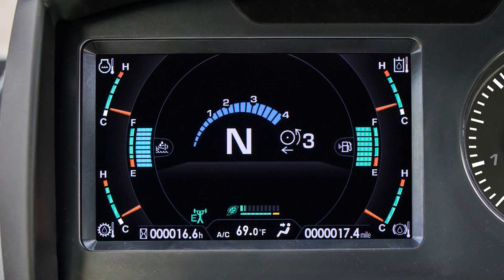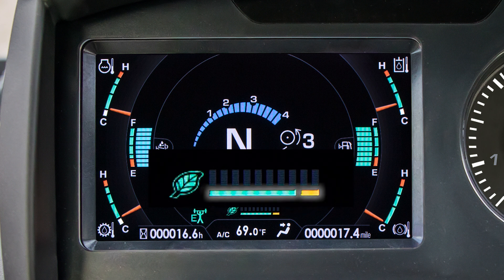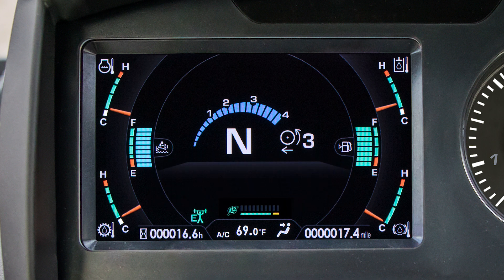The eco gauge, which shows the instantaneous fuel consumption, has been moved and is now just above the bottom center of the monitor screen. The instantaneous fuel consumption rate is the fuel consumption rate at that moment, calculated based on an average every three seconds and displayed over 10 levels, 17 to 43 liters an hour. This whole gauge can be turned on or off. The bottom bar is green on the left and yellow at the right, indicating the target fuel consumption rate. The floating step gauge changes as the operator uses the machine — the heavier the use of the accelerator, the higher the bars.